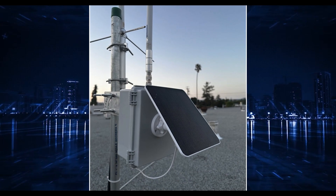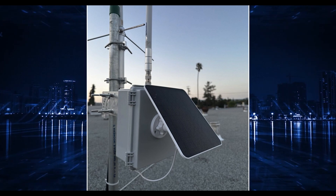Most builds use one or more 18650 Li-ion batteries or larger packs, with some nodes featuring up to 18,000 mAh capacity to ensure night and cloudy-day operation. For the enclosure, it's weatherproof — rugged cases, sometimes 3D-printed or military-grade, protect the electronics from the elements, making them suitable for tree mounting and harsh environments. The nodes run MeshTastic, an open-source firmware enabling LoRa-based mesh networking for text and GPS data without cellular or internet connectivity.